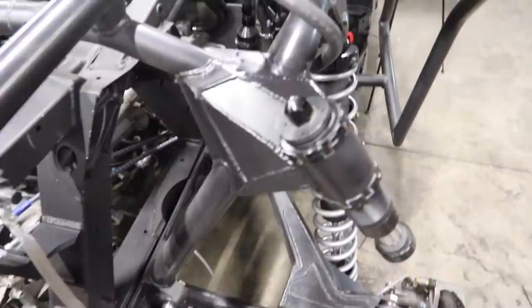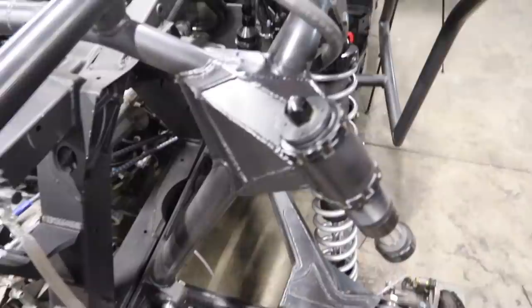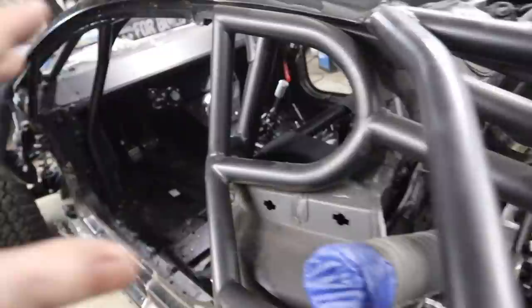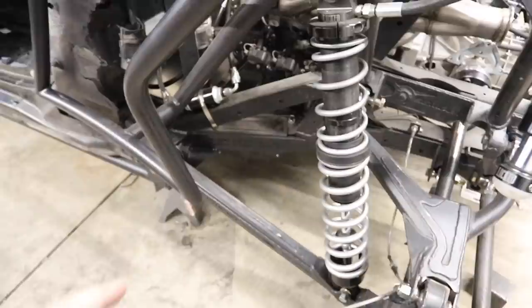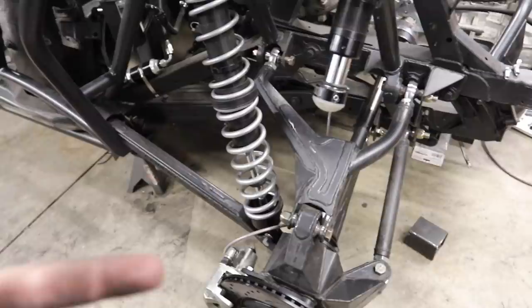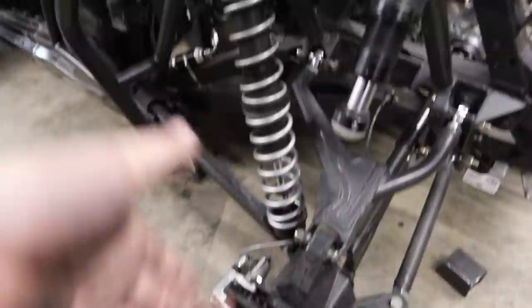The bump stop adjustments have been made — it looks fantastic. That was a really, really hard job to modify and move it down so much, and it came out really, really good. You can basically not even tell that we had to do that. I am currently working on the shifter — getting the shifter cables and the shifter adjusted so it shifts nicely. The guys are going to work on limiting straps. On a vehicle like this you don't want the shock to be the last thing that holds the control arm and wheel assembly when you go off a jump — you want a strap from the frame to the lower control arm so you don't blow your shock apart. We're going to have limiting straps on all four corners, figure out exactly where they should go, and weld and bolt them in.